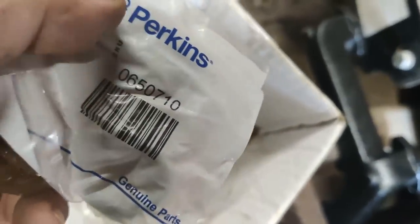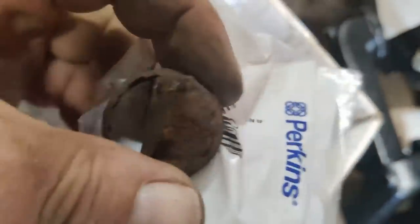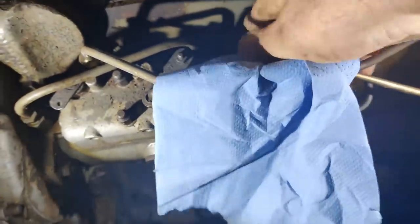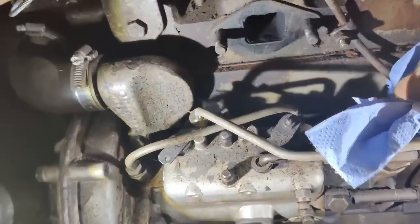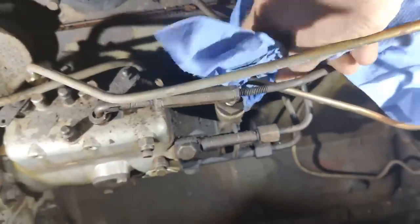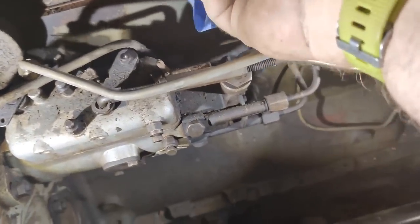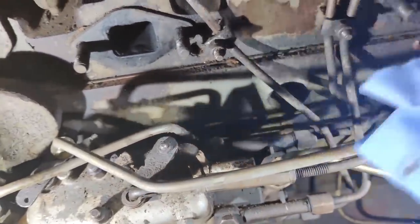I think that might be what we're looking for. Feels about right - I'm going to go with that. So next, I've cleaned the worst of the scale and the crap that was in that hole out as best I can without getting too excited about it. Next I need to get as much moisture away from there as I possibly can. Then I want to give it a nice brush up with a Scotch-Brite or something like that to get the inside of the hole clean so that I can put just a little bit of sealant around the new plug.